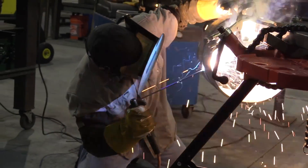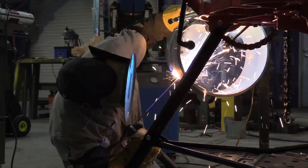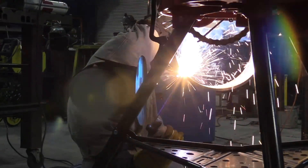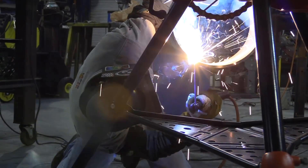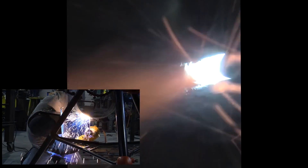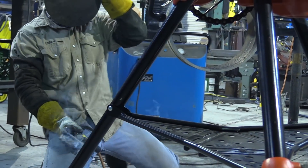You can see his rod is pointing just about toward the center of the pipe, and you don't see a whole lot of light on this side. It's moving pretty quick too — 5/32 is no joke; it gets a root pass put in there fast. Andrew is moving his body under the pipe, maintaining line-of-sight so he can see what's going on. At the bottom of a pipe like this you're looking at the puddle from a different perspective — there's no getting ahead of it sometimes, so you're looking at the rear of the puddle.